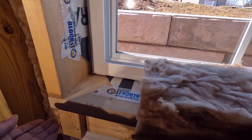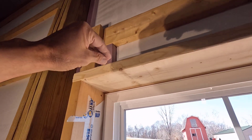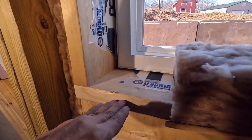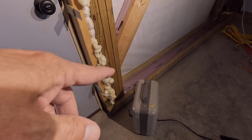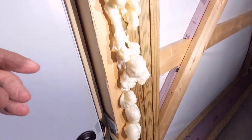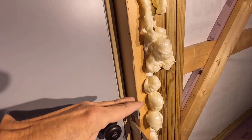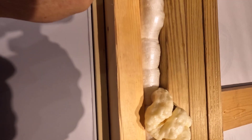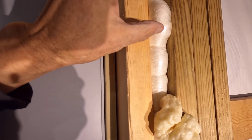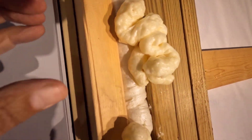This piece, which has been sitting here since yesterday, is going to cover the window area. Then the regular wall insulation will come right to the top of the window and then start from the bottom of the window and go down to the sill. I have the heater on this foam so it dries a little better. You can see the foam up at the top isn't drying as fast as the foam down lower. There is foam on the inside that isn't quite cured yet, and as it expands it will bust a little hole in the shell and make all these noodles like this.